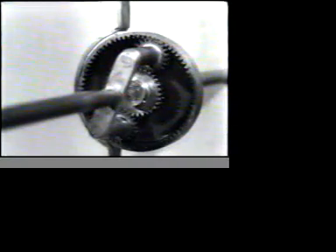Lastly, we'll add a brake which can be applied to the annulus to stop it. As soon as the brake goes on and holds the annulus still, the planet wheels begin to creep round inside the annulus. As they do this, they take the carrier round with them. If the brake comes off, the carrier stops. As the brake goes on again, you can see that the carrier is being driven round in the same direction but at a slower speed than the sun pinion. Thus, a reduction of gear or change of speed is effected between the sun pinion which drives and the carrier which is the driven member.